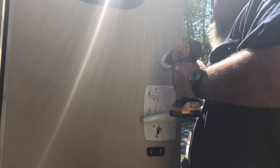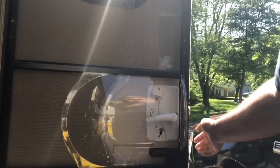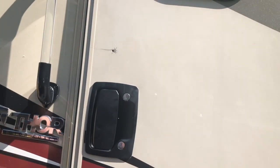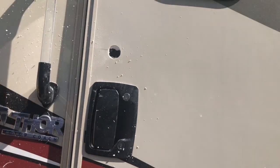As I go through it, I just want to make sure I do not go all the way through — I just want the drill bit to give me a small hole on the outside to know where the center is to drill from. As you can see when you pull that off, it's just styrofoam inside — not very strong. Now I'm going to take my step drill bit. I love step drill bits; it makes it so easy to drill a hole and keep it centered. I drill down to one and a quarter inch.